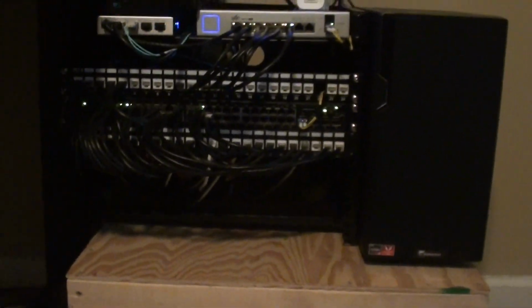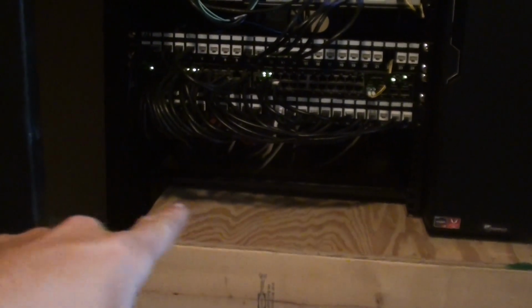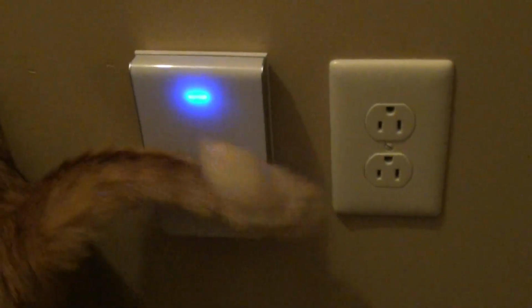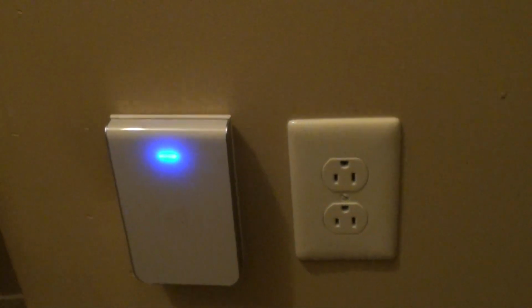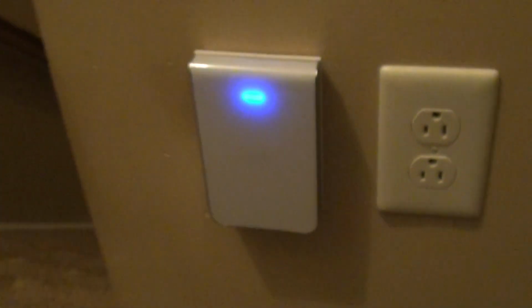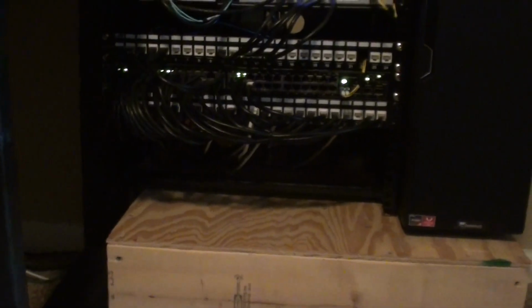But yeah, just thought I'd give an update, and this box is just hiding some power strips underneath there since I haven't gotten a power thing to stick in the rack. Well, here's one of my access points next to an outlet I installed, but it's powered with PoE from that switch. And I just installed the work box there and then fished the wall up to my attic. And then that's what supplies Wi-Fi to my upstairs rack.